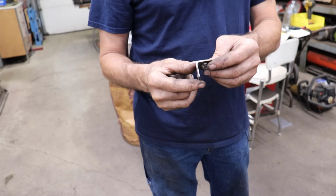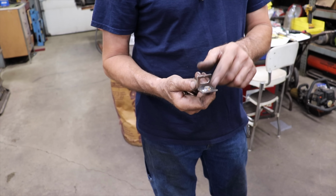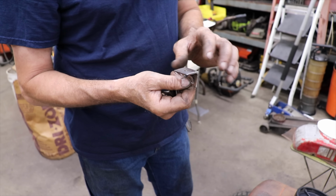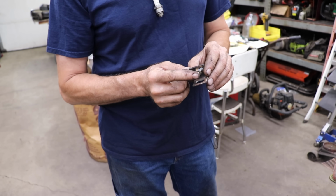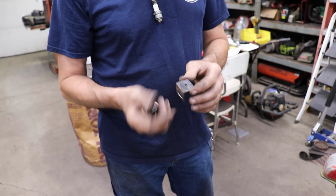that I'm going to mount to the engine block, and then I welded some nuts on the back. I didn't use nut certs because they stick down a little far. So I welded nuts because when I take the cover off, I want to be able to get the belt off easily. And with the nut certs sticking down a little farther, they're kind of too close to the belt, and you might struggle trying to get the belt off.